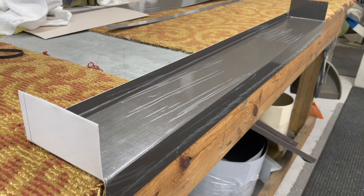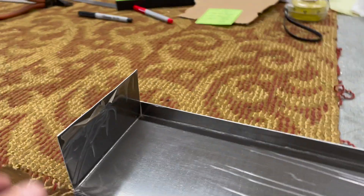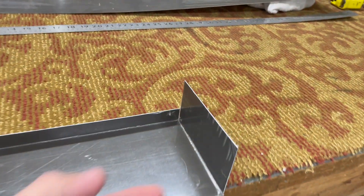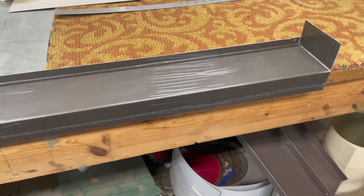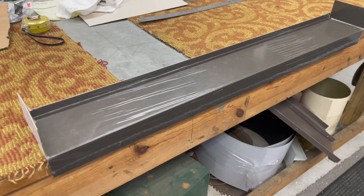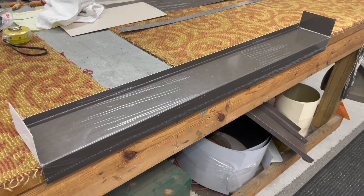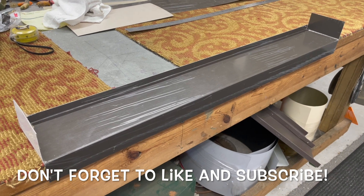We're done with the door pan — here's the finished product. These are the nailers I was talking about. You just slide this whole piece into your door jamb, nail it off on both sides through here, put a little bit of caulking on these corners so they don't leak, and then you should be able to slide your door right in. If you have any questions, let me know in the comments below. Give me a thumbs up, subscribe, and we'll see you next time here at the 509.